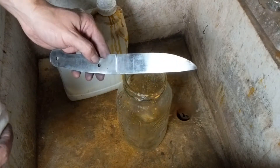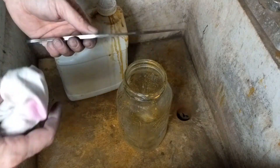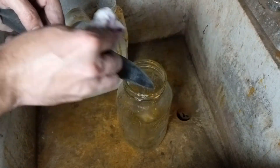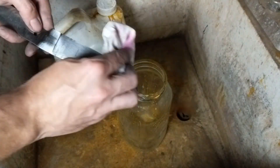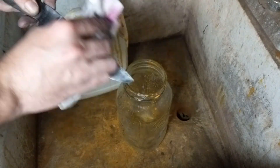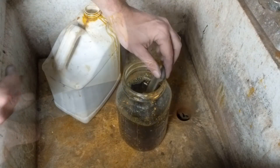It's not a real perfect finish — it probably doesn't need to be for etching. I still got some deep scratches that I probably should remove but I'm getting impatient; I want to see what it looks like. So I'm going to degrease it and we're going to go ahead and put it in some ferric chloride for the first part of etching it.